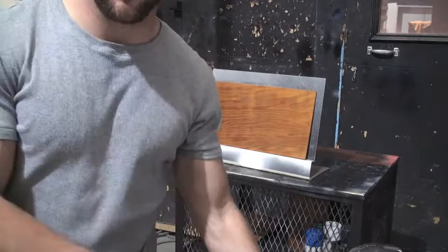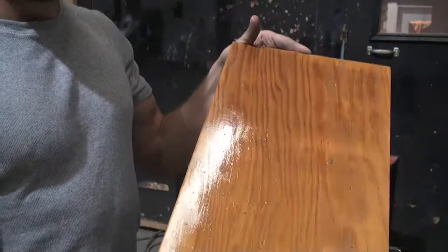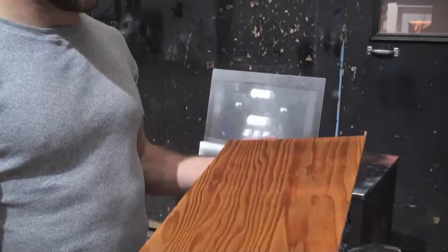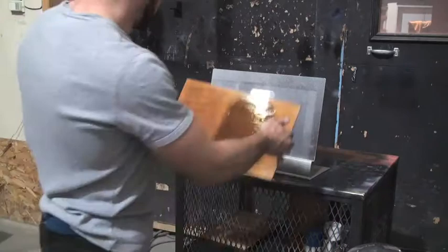In case you were curious, I was using a 1.5 millimeter nozzle there. And there we go — sprays out very nicely for a brushing lacquer. That's probably a pretty good option if you're trying to lacquer a guitar and you don't have access to nitrocellulose because of environmental concerns or whatever the issue happens to be. I hope that was helpful for anyone who's trying to spray a lacquer for whatever reason, and hopefully you guys enjoyed the video. See you next time.